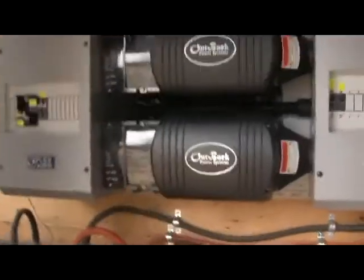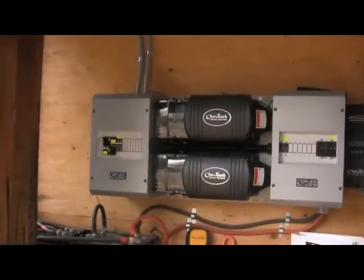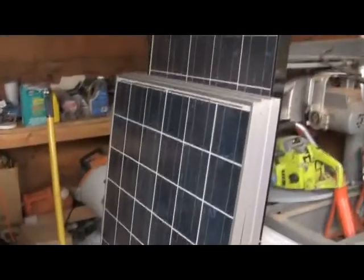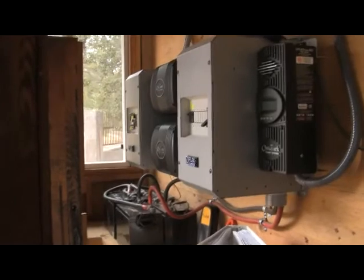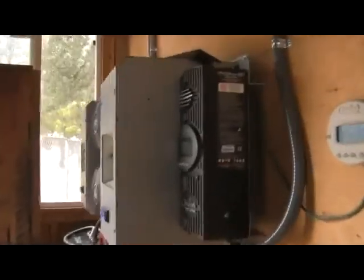Right now I have five panels on here for about a 650 watt nameplate amount of generation. But these over here are four more panels left over from my grid-tie project, and they will be going up on the roof as well, wired in parallel with the other string, which will give me around 1,400 to 1,500 watts at around 95 volts. It should work out very well — in fact it will be maxing out the charge controller when I do that.